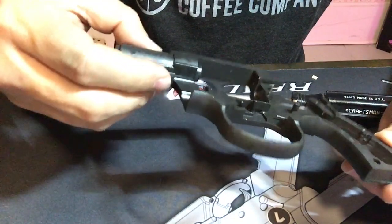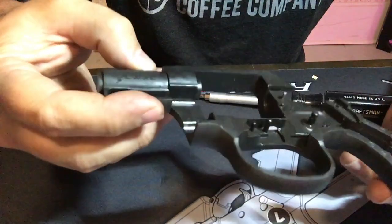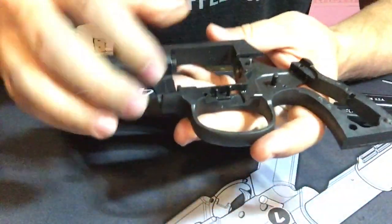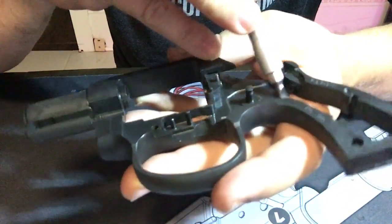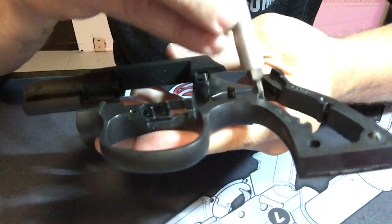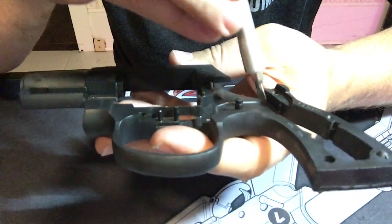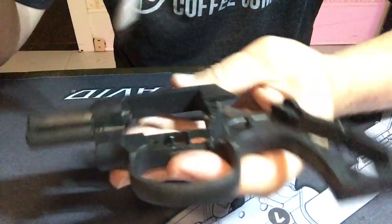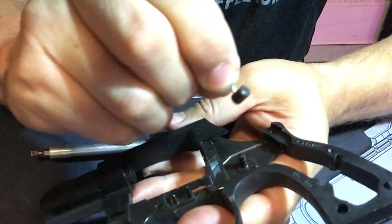What I'm going to do is clean any remaining oil out. There's some left because I'd never taken the trigger out before. So I'm going to get a Q-tip and some alcohol and clean this remaining oil out. Then I'm going to polish up some of these interior surfaces in here. There's manufacturing slag still left on some of the parts, on some of the edges — I'm going to remove some of that. Everywhere where a part rubs, like the trigger rubs here, anything that's gritty, I'm going to see about polishing any of these surfaces.